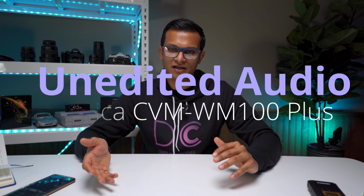So another great feature of this is, like I was saying, if you're doing an interview, say you have two subjects talking, one is speaking a bit lower than the other, what you could do is take the audio from one lav system, in a right or left channel, and then boost that audio. To do that, when you're in the receiver, you would just set it to stereo mode. Then you would make sure each transmitter is on a different group, so group A and group B.